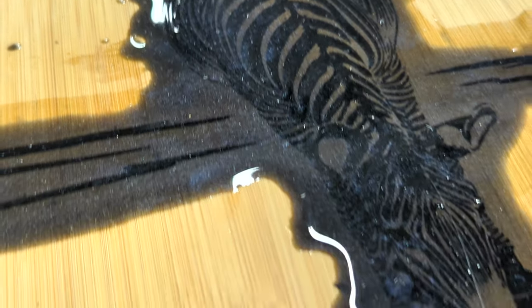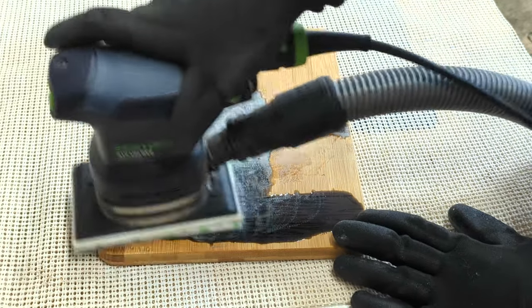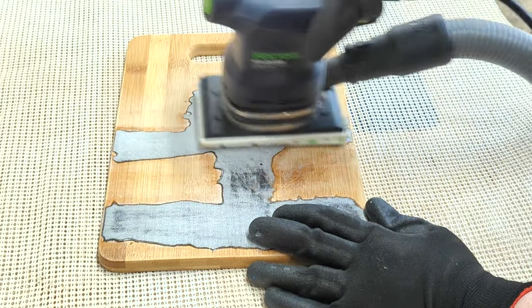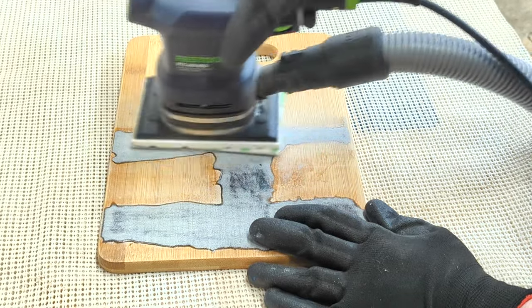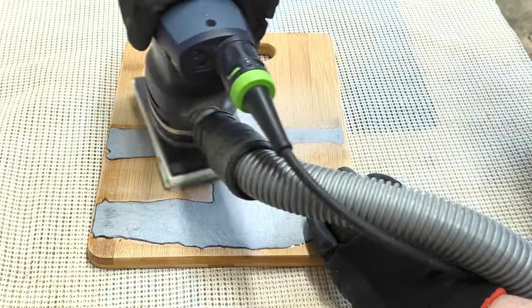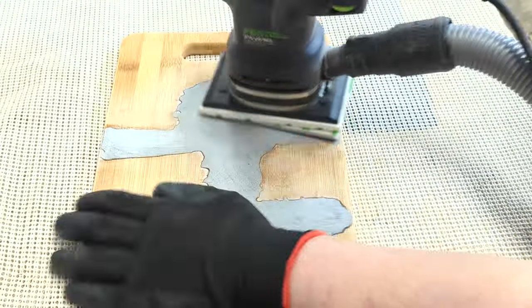However, if some remain, I'll put a link to another video which will show you how to remove these in the description below. I typically start with 80 grit sandpaper. Concentrate on the resin to get it close to the surface of the wood.